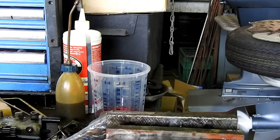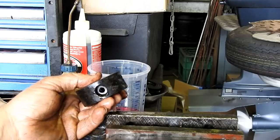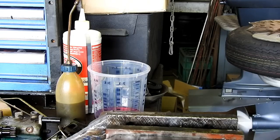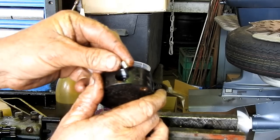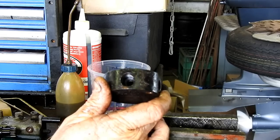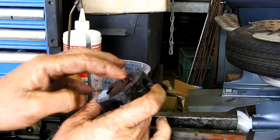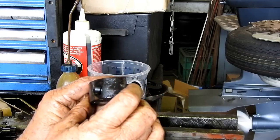That's another spring and a washer that it sits down onto. Oops, and that was the plunger I was looking for. That little plunger, it's a little shuttle. The fuel pressure just decides, it pushes against that little light hairspring here, and that decides whether the vane pump on the end here just loops the fuel there within itself, or whether it sends it down the port because it's needed into the head.